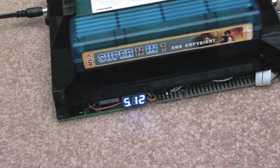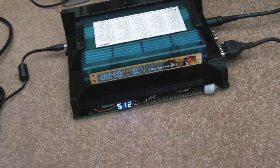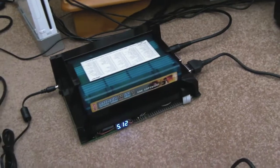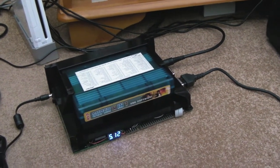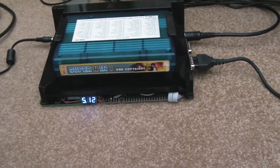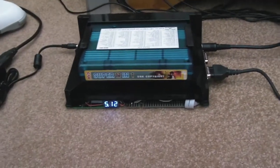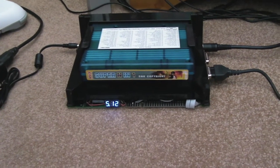I'm pleased with that little display — it's just the right height and size. It's dual purpose: it's showing me the voltage level for the 5 volt line, and it's also showing me that the thing's powered up. The little LED under the cart was a nice idea but you can't see it unless you've got a clear cart in. The little red LED is being intermittent on its own right now — I think the LED's on its way out. I've never had an LED fail on me before. It needs replacing, but at least now I've got a clear indication of the health of the power supply.